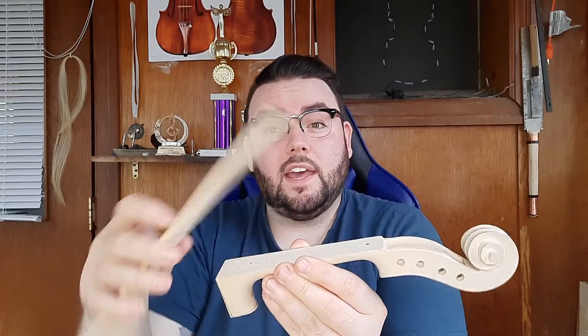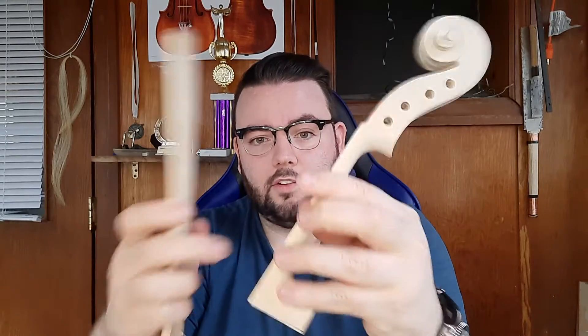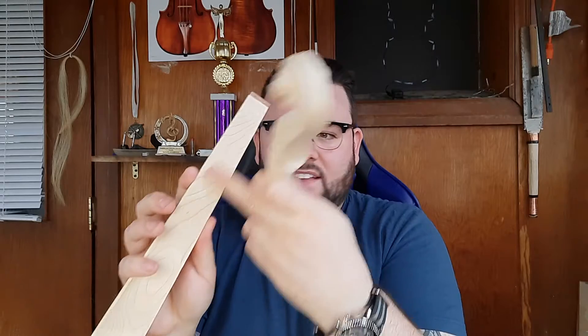The fingerboard came already attached. I removed it because the gluing surfaces were presumably not good — and I was right. There are big gouges and dings and it hasn't been smoothed at all. It is a surprisingly decent maple fingerboard though. There are a lot of mystery woods some Chinese factories use just because they look dark, like ebony, but end up being overly soft and wearing too quickly. This is actually pretty good sugar maple. I do a hardness test with a nickel coin, and I could not ding it, so I'm going to keep this fingerboard.